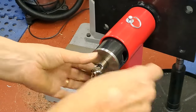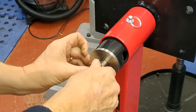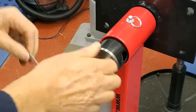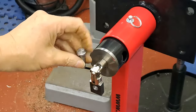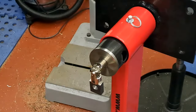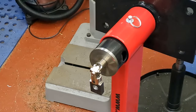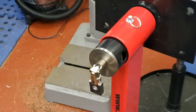I won't turn it up too greatly because I need to slide it around once we get lining up for a coupling on the locomotive. I've got the coupling pin ready, so that when things line up through the coupling and then through this, it'll all be held down tight. I've just got to loosen the bolt that's holding it onto the cross shaft at the bottom, so I can slide this head up a little bit to make it match the length of the loco. So just give me a second, guys. I'll find my spanner, loosen that, and I'll bring you back.